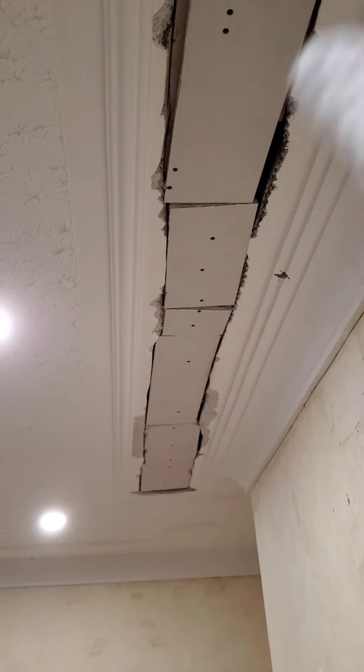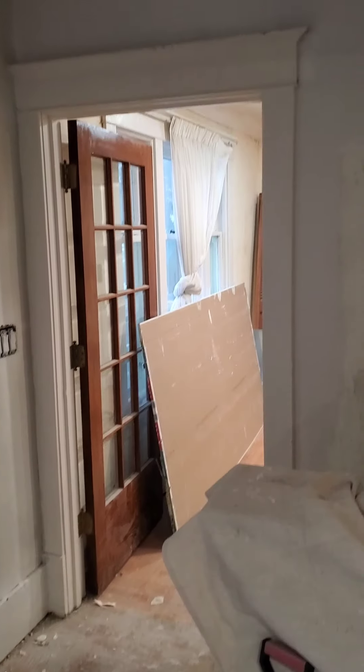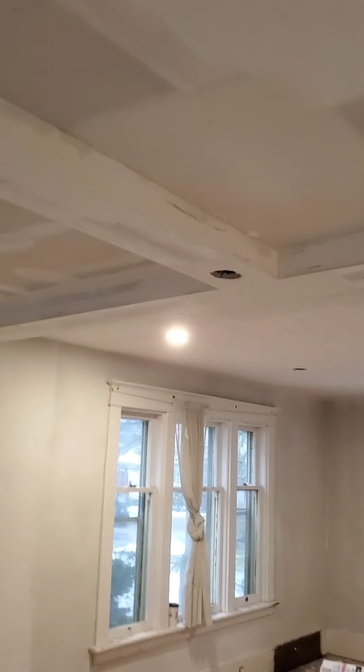So we're about three hours in, first day of coating, and we've got the first coat of the flat coat going on with the Sheetrock hard-setting mud. We have to use that to prevent crackage and to build things out, so that way when we use the regular finish coating mud, it will dry properly without having to leave it for a couple of days and have it shrink and then have to skim it again. We're going to build everything out until it's actually pretty darn close to true flat, so there's not going to be a lot of building with the actual finishing mud — it's just going to be a lot of skimming.